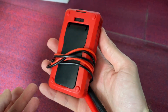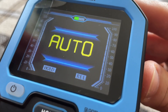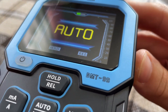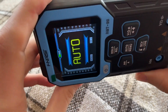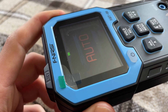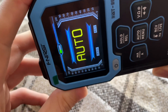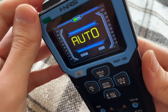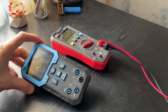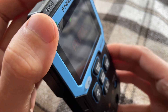Facts are facts. Second, the viewing angles. The display here is, to put it mildly, not the best quality — most likely the cheapest available. If you place the multimeter on a table and look at it from the side, the image becomes terrible. Colors distort, black turns to white. You can still make out the values — the high-contrast yellow font helps — but it doesn't compare to a good monochrome display. Only after using the device in real life do you realize that a color screen on a multimeter is more of a downside than an advantage, and a noticeable downside at that.